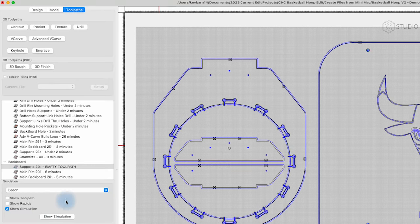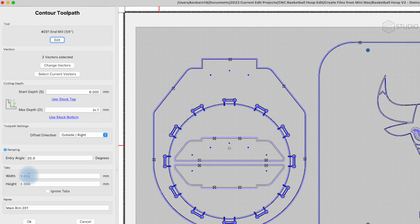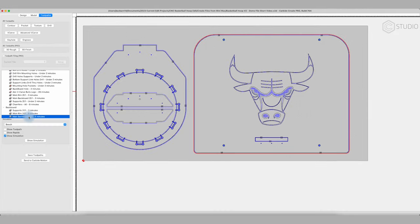By going from a 251 downcut into a chamfer back to the 201 upcut, I've created two sharp sides. I will have less sanding, almost nothing to do on either side when it comes out of the machine. I'll just have to break the edge and there should be almost no tear out. I also mentioned I wanted this rim to be stronger. I'm going to use Baltic Birch. That'll make it a lot stronger. Let's head off to a cutting montage and get this thing done.